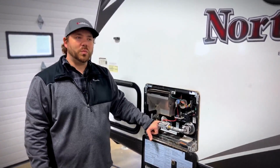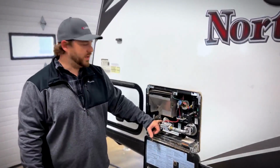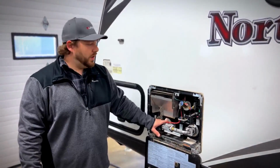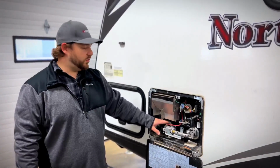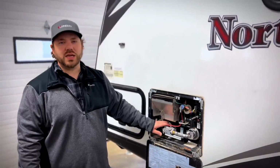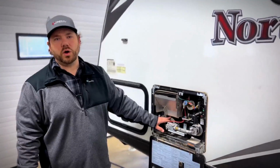For those of you that leave your bypasses completely closed and everything like that, same premise here, because if any water gets trapped in here, it can cause damage to the metal tank. So you don't want antifreeze obviously to go through this, because again, this is your water heater, and if you do get antifreeze through there, a simple flush will take care of any problems, but you do want to prevent antifreeze from getting into your water heater.